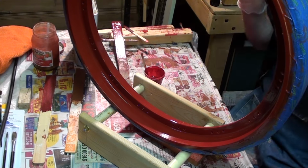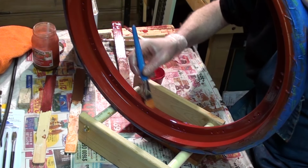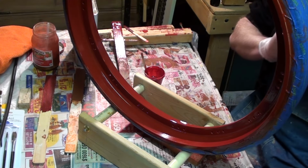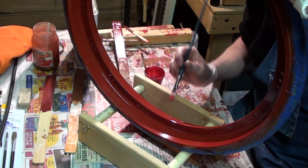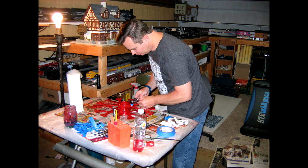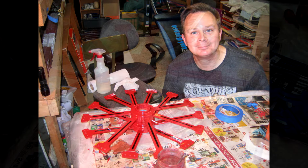Initially, we tried brush painting, then using a second brush to lay off the coating. The paint was modified by a portion of Flood brand Penetrol to help the paint flow and level. Our technique certainly took a long time to perfect, as did the mixing ratio for good results.